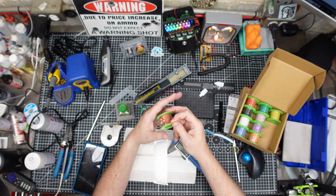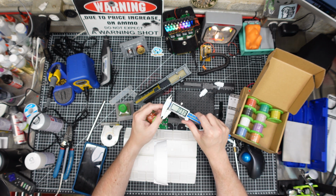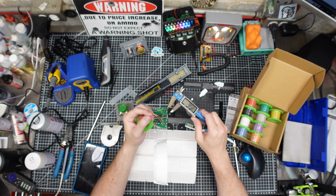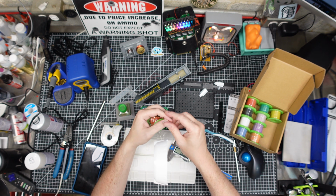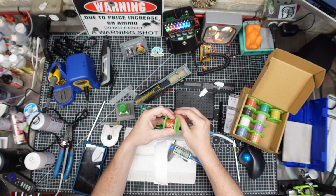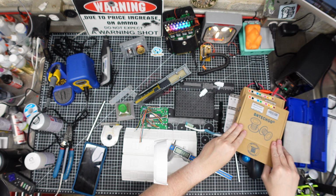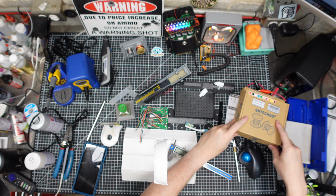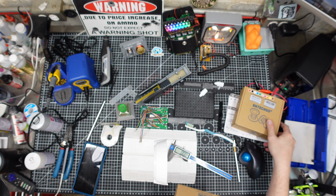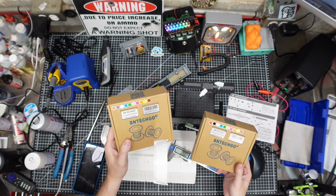And then we go from the 28 to the 30 gauge. Here's my concern, is that now I'm at 0.71 with that somewhat thick jacketing. I'm a little concerned these might have an issue handling the current. I don't want the wires inside the ship to overheat. Well, it is silicone jacketed, so they can take the heat a little better than vinyl jacketed. But I'm not sure if I'm going to try to squeeze the 28 gauge through that tube or the 30.